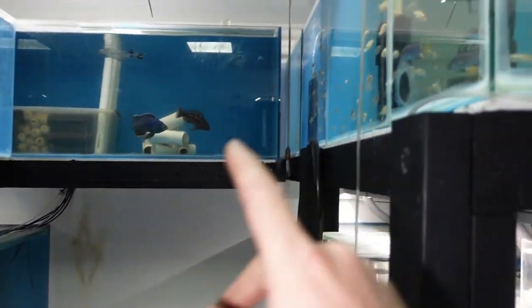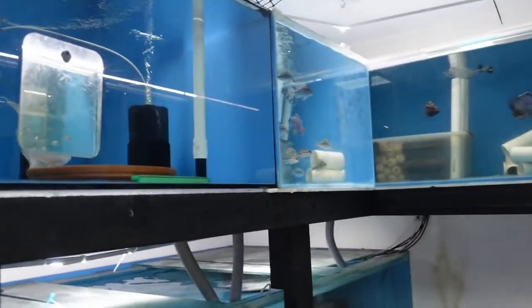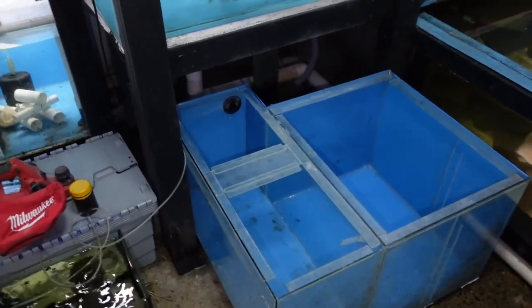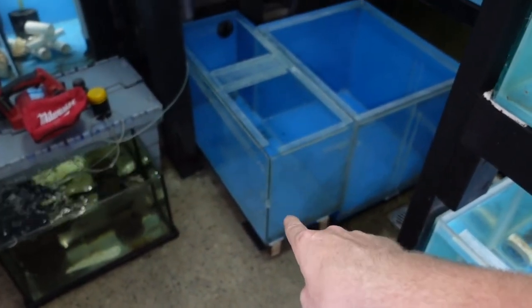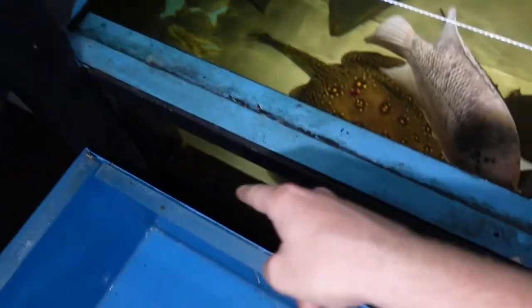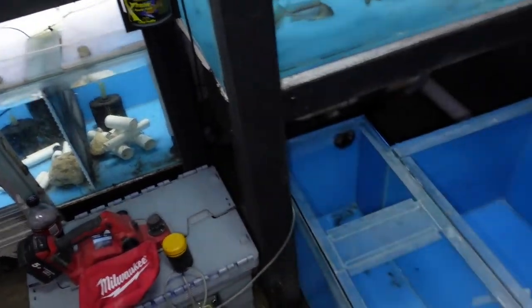My off the top of my head guess is 600 to 650, 400 to 450, 450 to 500. Anyway, we have a planer in the vicinity, so we're just going to plane the hell out of this leg. I'm going to try and plane it a bit tapered so I'm taking as little as possible. Luckily this tank here is like 70 millimeters up off the ground so I don't have to plane to the bottom of the leg. I can't really plane the other side because that tank goes all the way to the ground and the planer will only plane to within about 30 millimeters at the bottom.